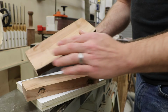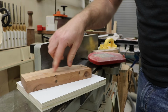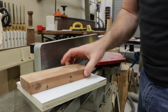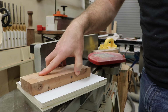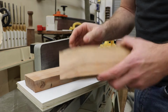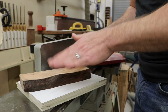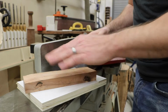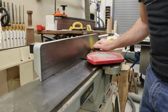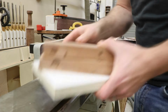Now, I have now put one solid flat face on there, so that's stable, and I can safely run it through the table saw. I would not want to use this edge where it rocks and run it through a table saw because I'll get an inconsistent cut and it's dangerous, especially one like this that rocks like a boat, okay? So I've got one flat face down here now because my jointer uses these reference planes and cuts the board flush on the bottom.